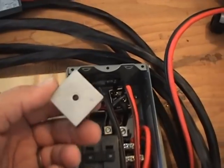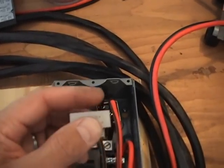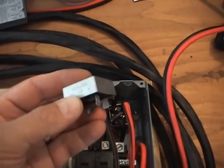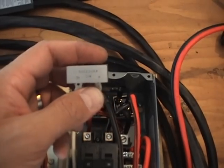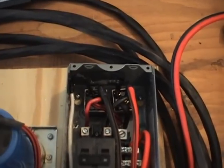You've got your positive output DC and your negative output DC, and it's that simple to hook one of these up. I would suggest using a fan inside your box or putting a nice heat sink on top of this to keep it cool. They are rated at 70 amps, but realistically, how many components actually perform at their rated spec?